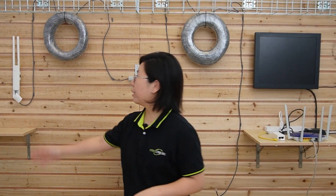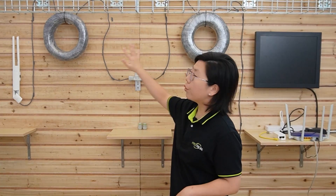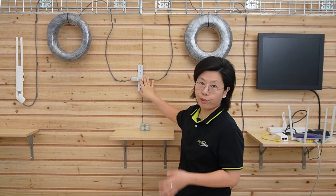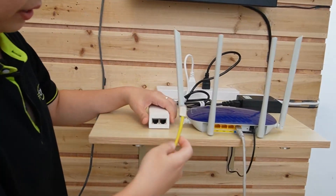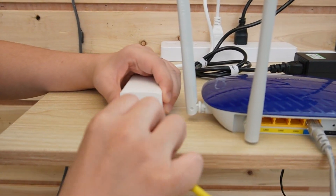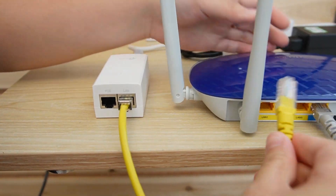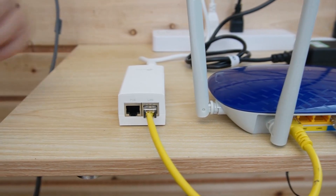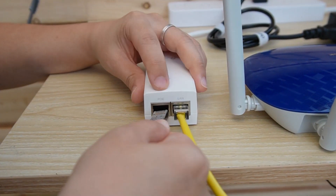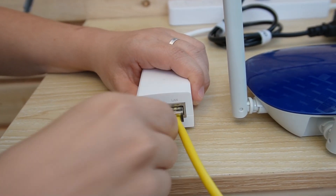Behind me is the setup for today. We are going to connect to a TP-Link wireless access point and extend the reach for 200 meters in total. The PoE extender is already placed in between. First, we are going to try to use the TP-Link injector — we'll plug in the Ethernet cable to the LAN port and to our router, then use a 100-meter Ethernet cable to plug it into the PoE output port.